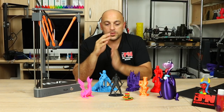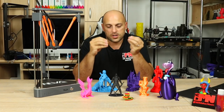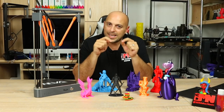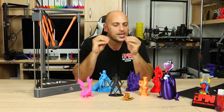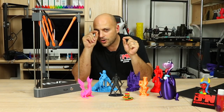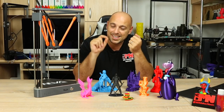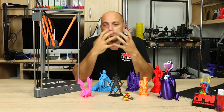There are a few things that Dagoma need to work on. First is the filament sensor — the fact that it's sometimes a hit or miss makes me think it's not exactly the right type of sensor. Looking through the hole where the filament goes, I sometimes see the switch pop out and sometimes not, which means it's occasionally getting stuck. That is the issue with the sensor.